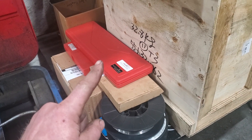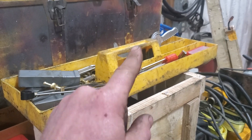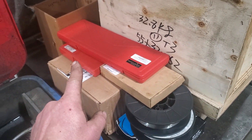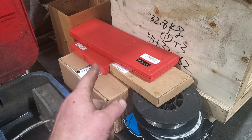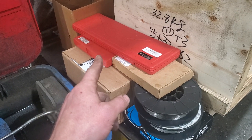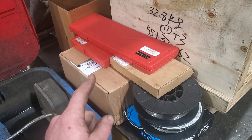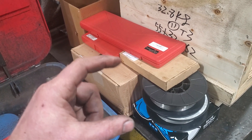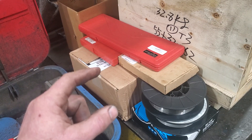That is a 12-inch slide caliper — my six-inch is in the side of the truck. That is high-speed steel tooling. Those are my T-gauges and snap gauges that I use for measuring. I measure off my bar to the bore, times that by two, and add the dimension of my bar to come up with my bore size, because I don't have the tooling that fits inside the tool ports of my bar — so I just do a little bit of math.